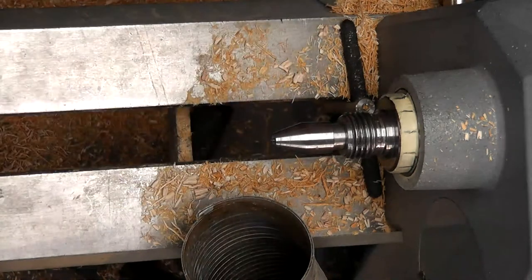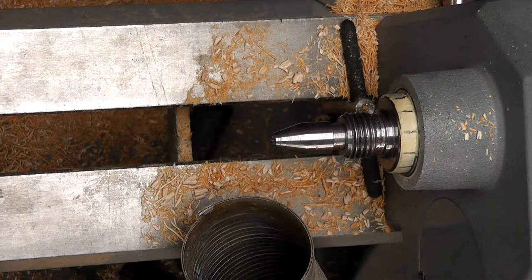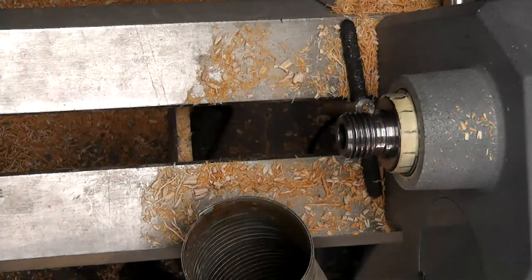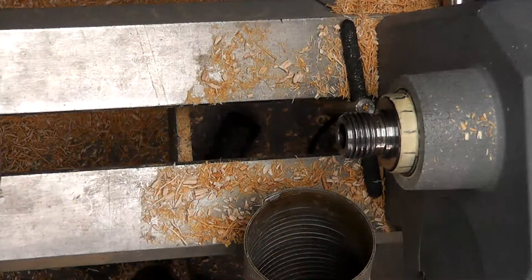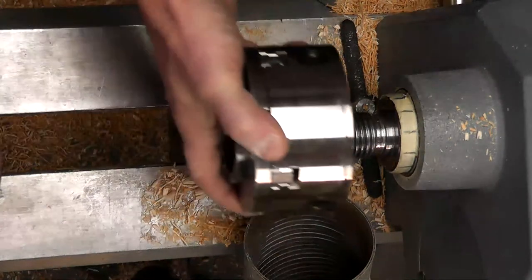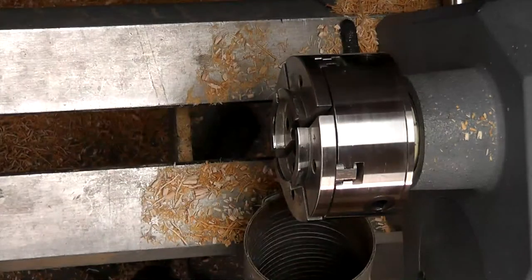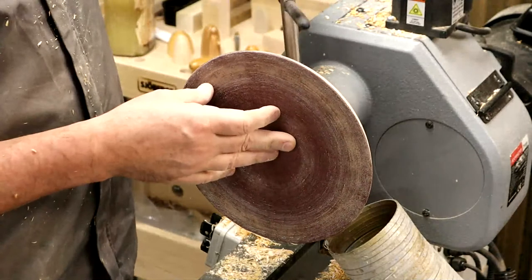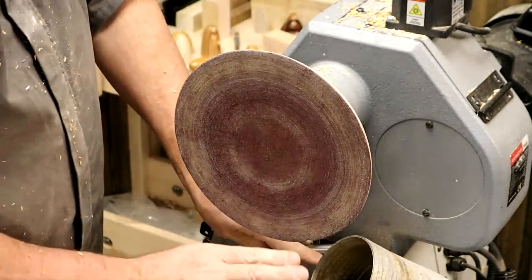So, sanding disc. I don't think any of you out there are going to be surprised about the sanding disc. It's just our regular sanding disc we use on our C jaws on a faceplate ring. Dust extraction is coming on as well, again for obvious reasons, but there we are, my C-jaws. We've got our faceplate ring on the sander. That's going to slot onto that on the dovetail. Dust extraction right below, really important.